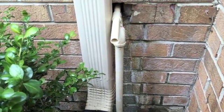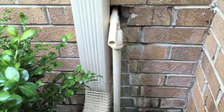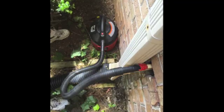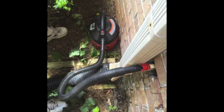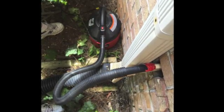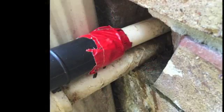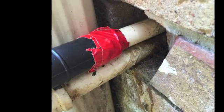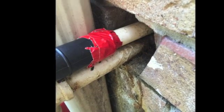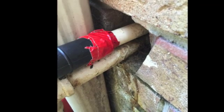What you're looking at is the end of the condensate line for our air conditioner at our condo, and it was not draining. So I hooked up the shop vac to the end of the line to suck the gunk out of it and get it draining again. I put the hose on the pipe and taped it up, hoping that would be good enough and keep me from having to go to the big box store and get some other stuff to make an airtight connection, but it wasn't.